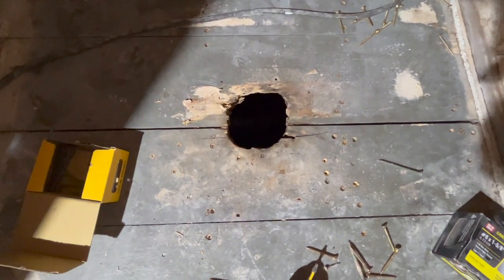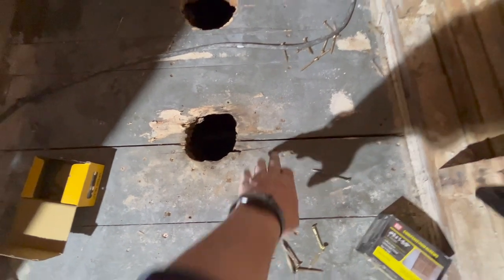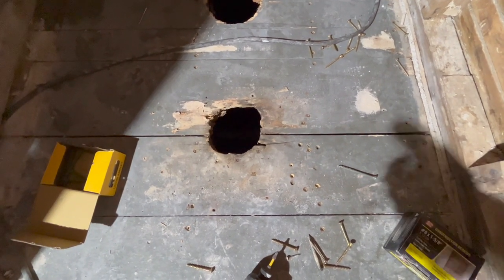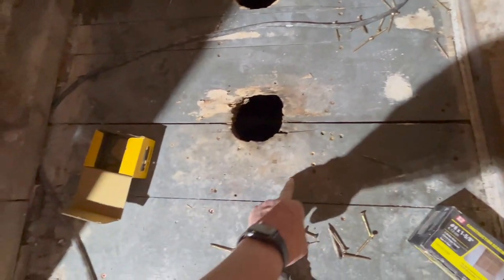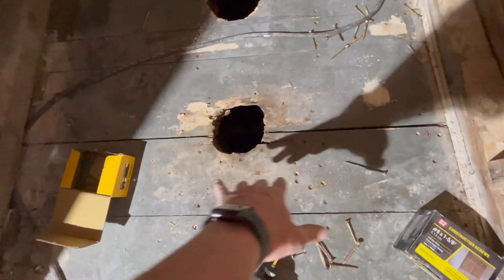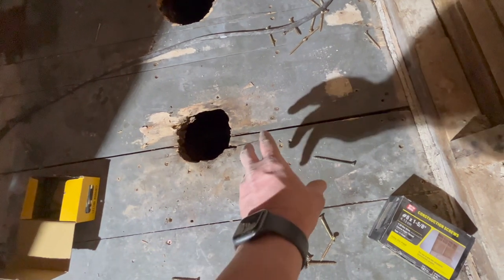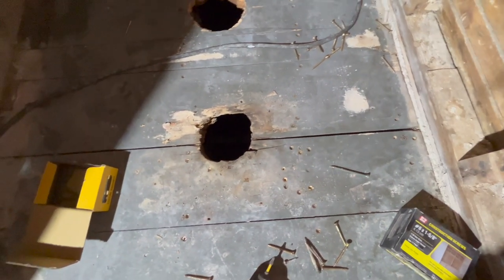That's a bit of a mess, by no means perfect, but it's a lot better than it was. The lip here is not as severe as it was and I'm going to go over this with probably half-inch plywood and we shouldn't notice any difference. What I was concerned with was making sure this was fairly even and at least stable. I put a piece underneath to make that more rigid because it was quite a span without the subfloor, then used a piece to pull that board down and loaded it up with screws. That's going to be it for this video. Thanks for tuning in, please like and subscribe, and we'll see you next time.